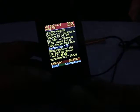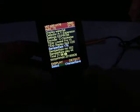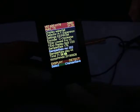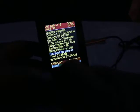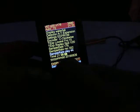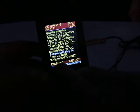This is the sample rate setting — a sample rate of 176 kHz is one I like to use for live listening and viewing mode. But for recording I like to use 352 kHz, the highest mode, to get the most detail. And 44 kHz is a nice playback frequency so you can hear the recorded bats — because if you played back at the same sample rate you would not hear the bats.